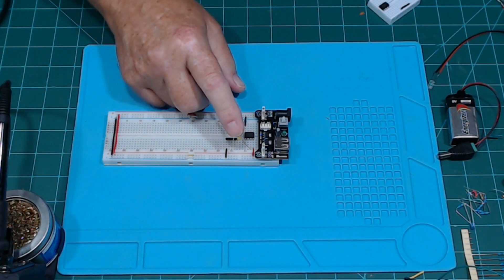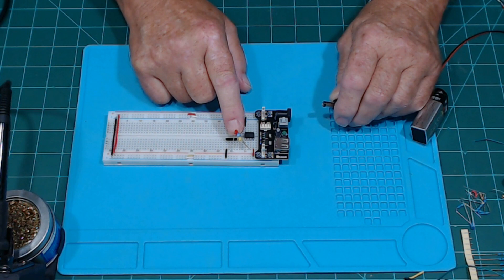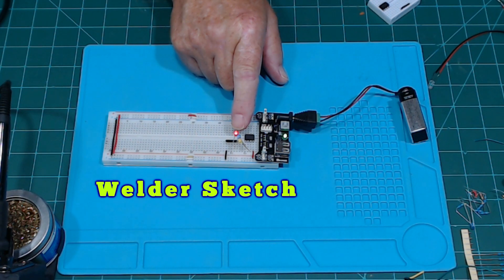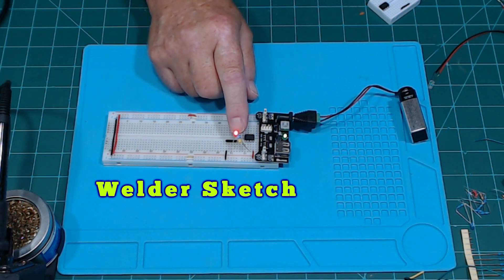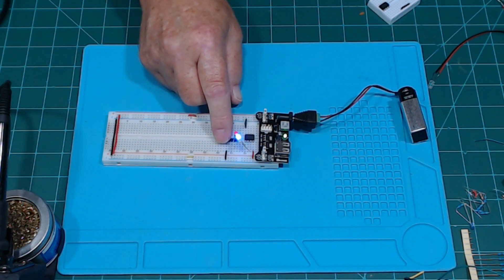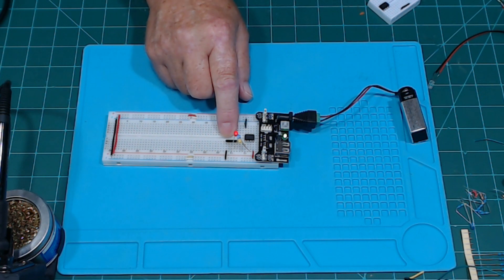Here's one that I have already set up. I have three LEDs on it and I have loaded the arc welder sketch on there. Let me put some power to it — it uses an Arduino sketch and you could program into it anything you want through your Arduino Uno. All I have here is three LEDs, the ATtiny85, and a SIP resistor — a 330 ohm SIP resistor which utilizes four resistors and a ground.